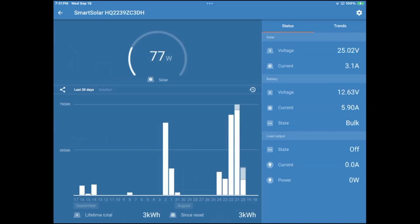So our voltage is varying — it doesn't matter. We're basically giving this a very level playing ground. We want the solar controller to push out to the batteries the proper voltage and current and be consistent. That's the solar controller's job, and it's very smart at it. So let's let it do its job. Let's feed the solar controller a nice amount of power, not let it be all over the place. Let's do a consistent current — put her at 50 volts or wherever you want to run. Keep the solar controller happy. I've done a lot of research and it's happy at a higher voltage. Running solar panels in series, upping my voltage, made this controller a lot more efficient. So for those of you who already have solar systems — panels on your house, in your rigs, your pod — you already get this. The whole idea of what I'm doing is not using solar panels but using something else.